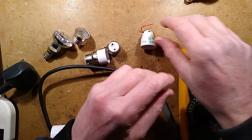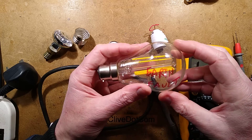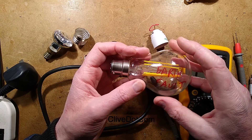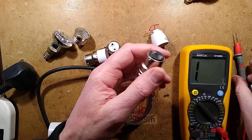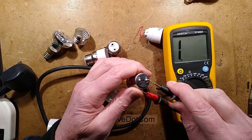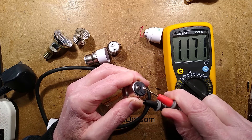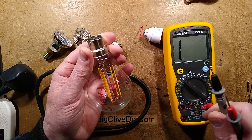Now, to be fair, occasionally you'll get a British lamp. This one came from Asda. It's clearly faulty because I was demonstrating how bright this new Asda lamp was to my brother when it tripped all the power out to the house because it tripped the RCD. And this one does — let me demonstrate — this one does have an electrical connection to the pins. It's not that direction, so it's clearly through the rectifier, so it's on the circuit board. The circuit board is making contact with the case at some point, and this does trip the circuit breaker.